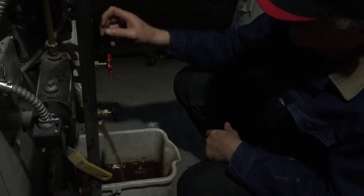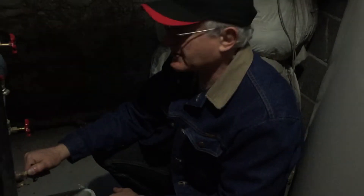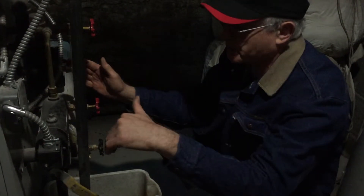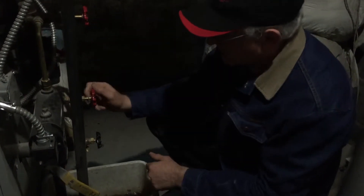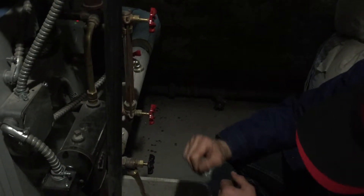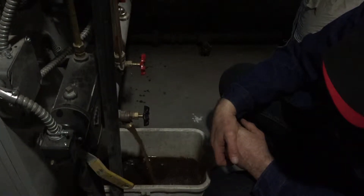So is that something you want to do? Yes, I will open up the skimming. If the boiler is not making steam, you can open it up. You can shut the boiler down and then do that. So you open up the skimming point to let the air in and you drain it a little bit — like 30 seconds — until you see it clear.